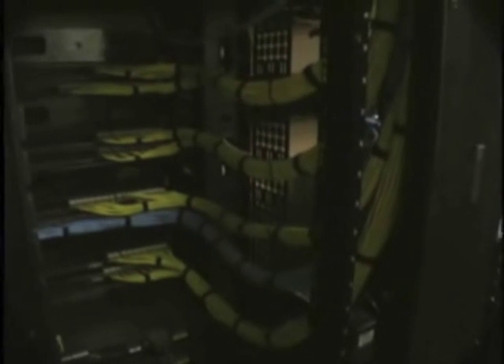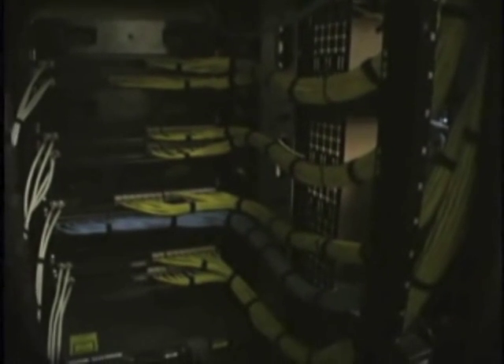You've seen what we have in the existing facility to connect up to our legacy studios. Now we can look at how we're integrating with the Axia. We're looking at one of the wiring closets that handles the third-floor news studios. We ran CAT6 cable from patch panels — just like a regular business LAN — out into each of the studios to connect the Axia nodes into the Cisco switches that handle all the audio. Below the Cisco switches you can see the Axia mix engines, all centrally located.